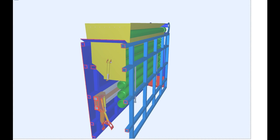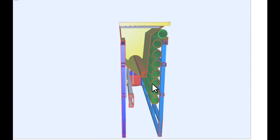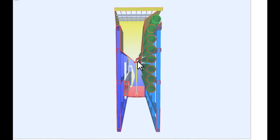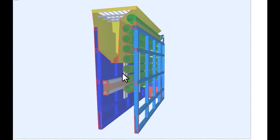That cylinder pulls a 5-inch square tube that we use with a scraper on it, that lifts up and lets the stone fall out. So then to shut, it just drops back down. You know, a broken hose or anything, it would just shut. The weight of the stone would push it down.